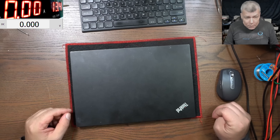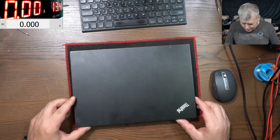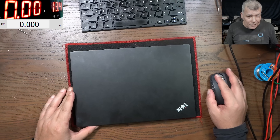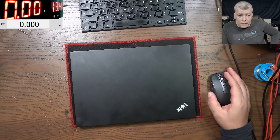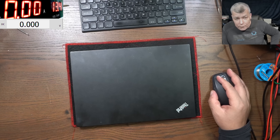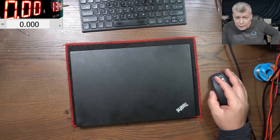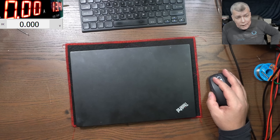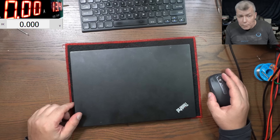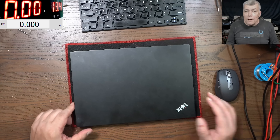Hello, we are back and this time we have a customer job. It's a nice laptop — a Lenovo ThinkPad L13 Gen 2. The customer says a computer shop had some suntan lotion damage, the laptop was cleaned by them, then it worked three weeks before failing to boot. They can't swap the motherboard because they don't have the BitLocker key, so it has to be repaired. Currently the fan switches on but nothing else.